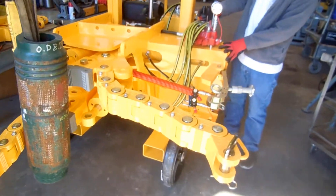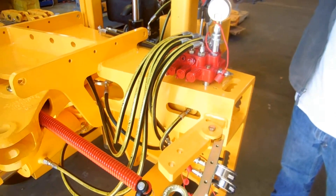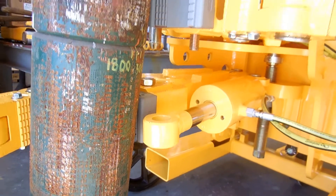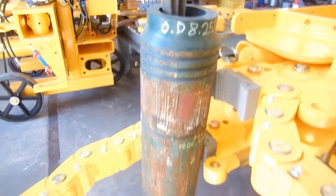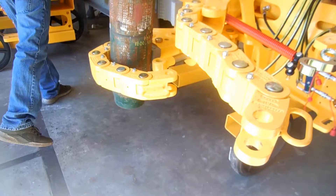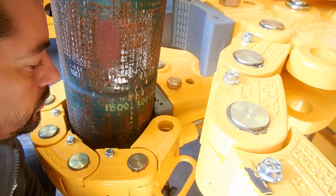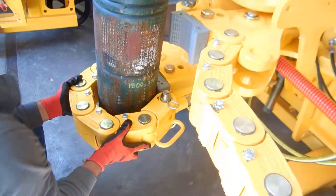Once the height of the machine body is oriented correctly to the joint, it is time to achieve grip on the pipe. Grip is achieved using the backup arm first. The operator is extending the cylinder rod so that the chain, when wrapped around the OD of the pipe, will reach. The chain is secured to the cylinder ram using the pin with the welded handle and secured with a hairpin.